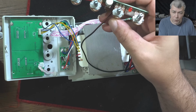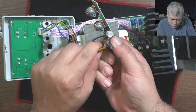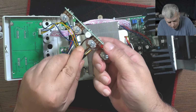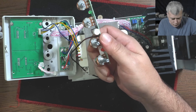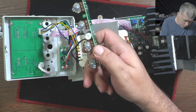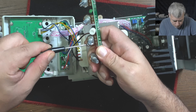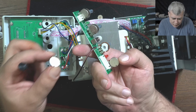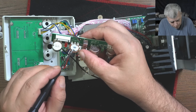So check here, yeah? Those potentiometers, they have 4 fingers here. I don't want to break it. So they have those things. Yeah, you can see? So we can bend them. And you can remove the back metal. Properly nicely made. And this one. Yeah, and now we can have access to the back of the potentiometer. And here can be the problem. You see those things moving here?